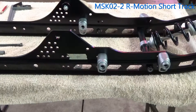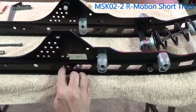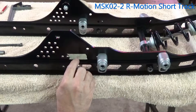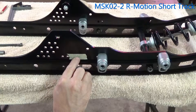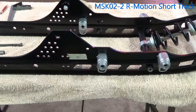The way we're going to do that — there are two holes here on your rails — we're going to put a piece of tape on here, mark it inch and an eighth, and center-to-center with these two holes we'll put a mark, drill that through with a one-eighth drill bit, and then go through with a quarter inch.